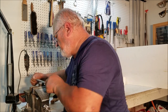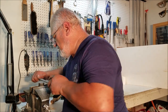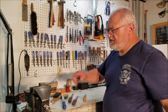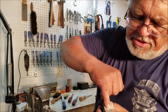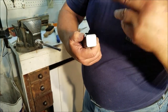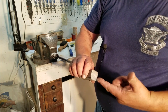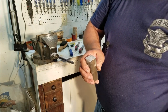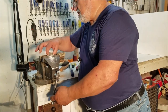If my cameraman can get a shot of the edge here where I've been filing — this is what was cut with a hacksaw. The edge here, it's smooth and it doesn't have any grooves in it. It's just leaving a very pretty edge. You can see what we started with, with the striations that were in there because of the hacksaw, and we're starting to flatten this now. It's not flat yet, and the filing I was doing there was starting to bring this down to flatten it.